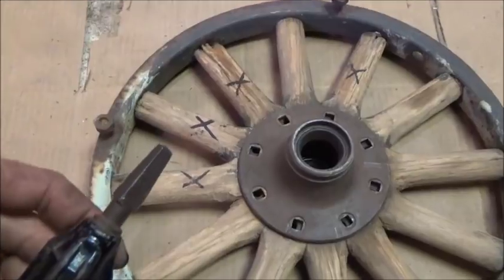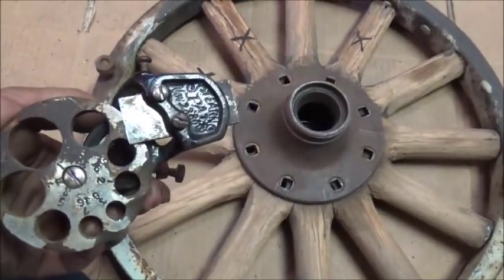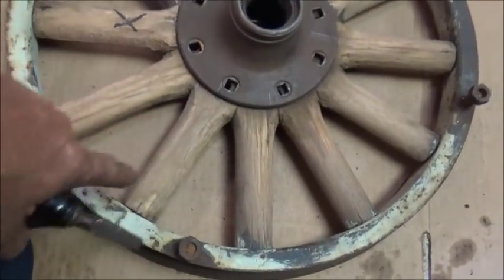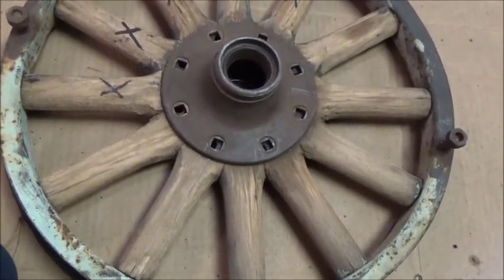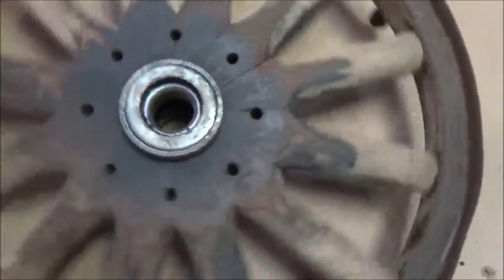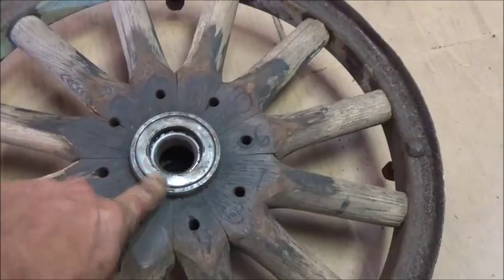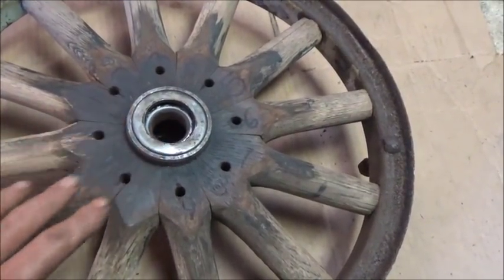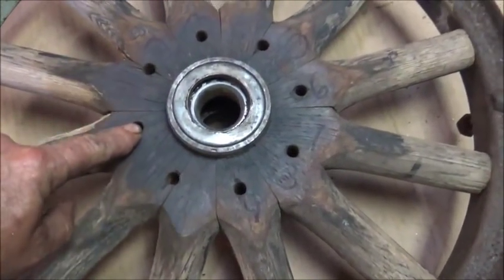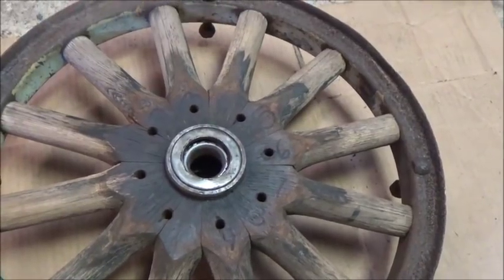If we can get it out and get a round shaft on it, we can mount this up in the milling machine, dial indicate, get our spoke exactly above it, come down on it, and cut the end with the dial — that'll cut it to length. Me and Noah had already bored the center hole to fit this hub, because this is a back wheel and we're putting it on the front, so we've got that done. The spokes are all the same but some are flipped — that's the only difference.